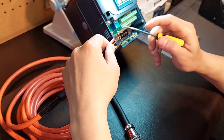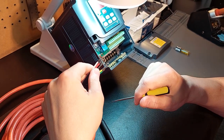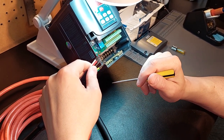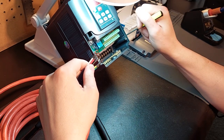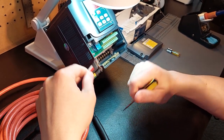The reason I'm really covering this in detail is because China is now releasing different paperwork from different vendors, as you saw prior, stating not to connect the two grounds from your spindle cable to the ground on the actual VFD. This is ridiculous.